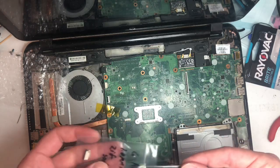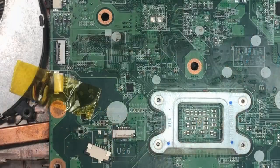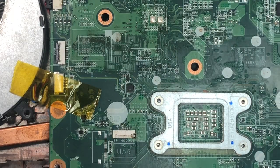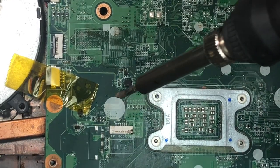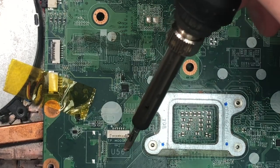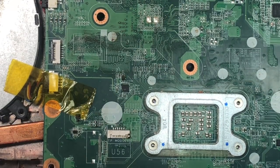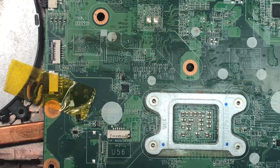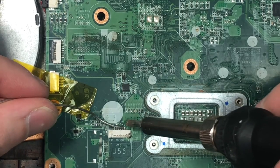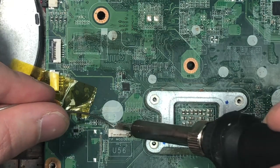This is not necessarily needed — I just need to grab onto something. It appears to be the right pitch, good. We always want to make sure the battery is not plugged in and the power is removed — I would assume at this point you've already made that decision. Next, we're going to take the soldering iron and make a solder bridge — think of it like construction, we're going to make a road. Always important to keep your tip clean. We're going to make a solder bridge for this connection here, and you'll see why in just a minute — so we can lift all the pins up at the same time.